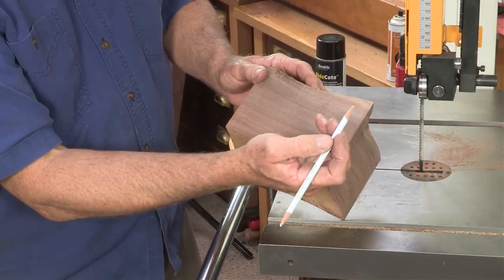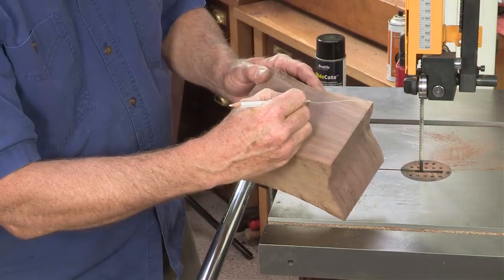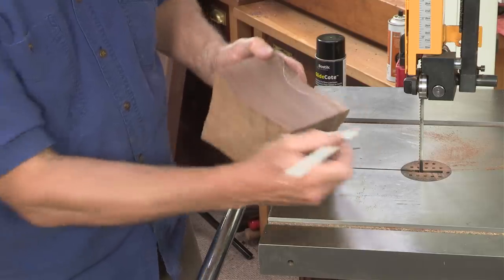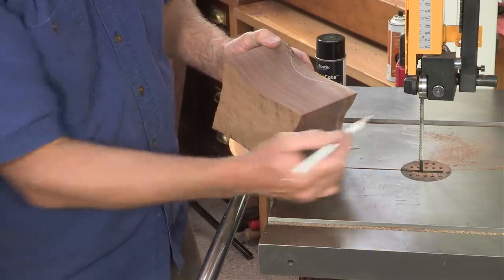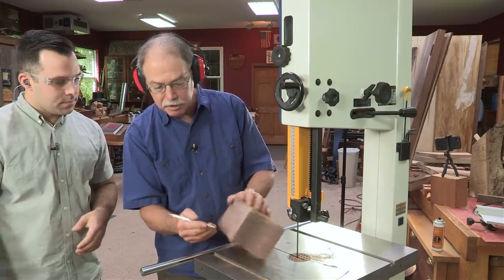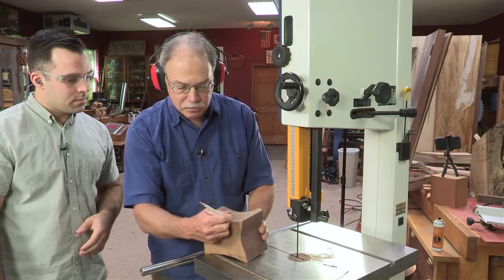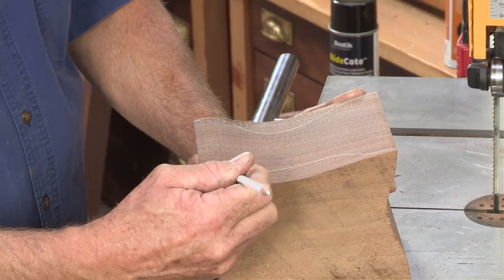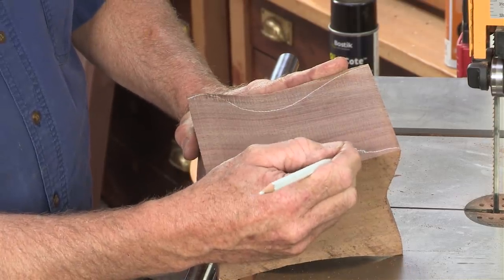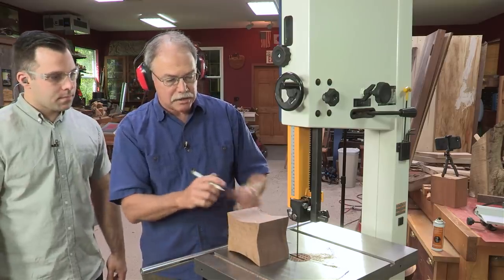As I'm looking at the shape of this, we're going to start high and sweep through that sapwood, then come back up like that. With this quarter-inch, six-tooth blade, it'll let you do that very easily. This is going to be the bottom of the box, so on this side we're going to come down to a foot right there — that way it'll make it look proud as it's sitting up and create some air.